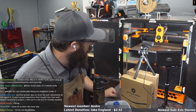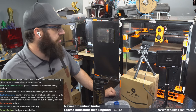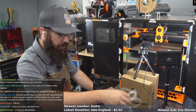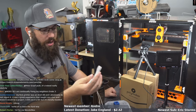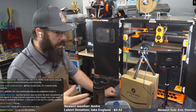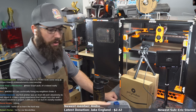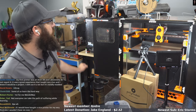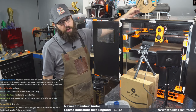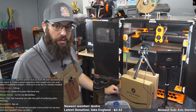But yeah, it seems like a nice little hotend. Installation went fine. We had to do a little bit of crimping because, you know, we had to. But if you were installing this in something like an Ender, it probably drops right in. The wires are probably long enough. You wouldn't need to do anything. PID tune and off to the races. It printed PLA fine. We only did one test print, unfortunately, but I will do some TPU printing tonight. It doesn't have a hardened nozzle, and the nozzles are proprietary. That's pretty much the only thing I can really critique it on.